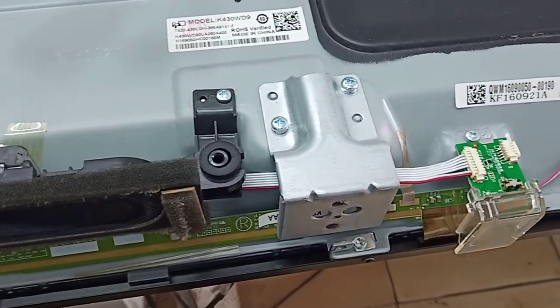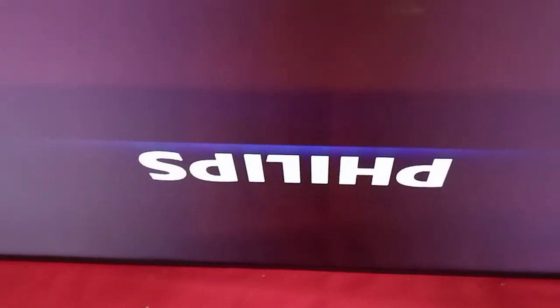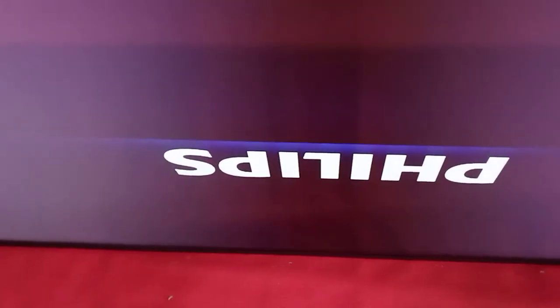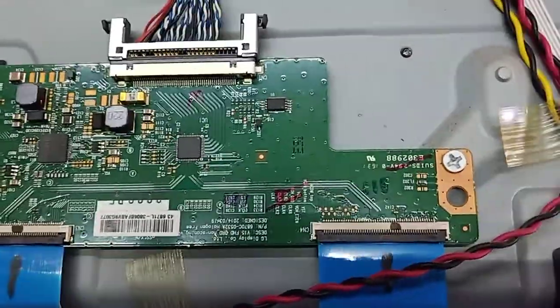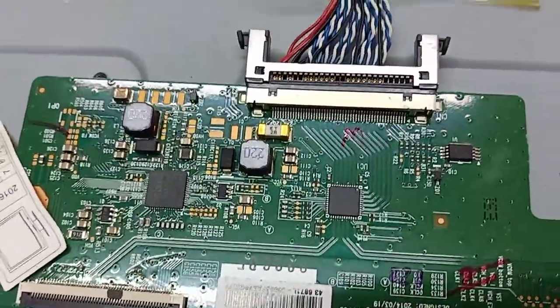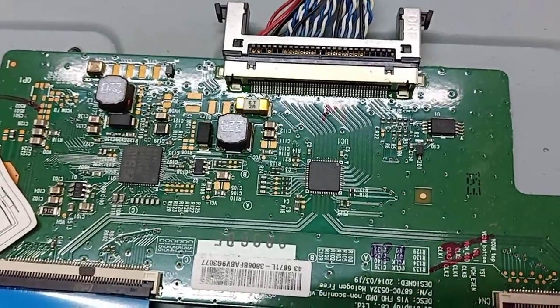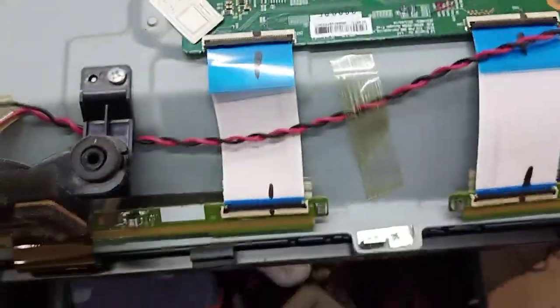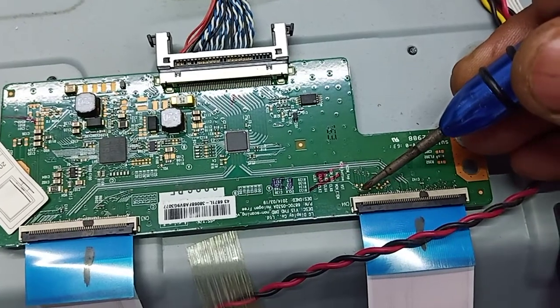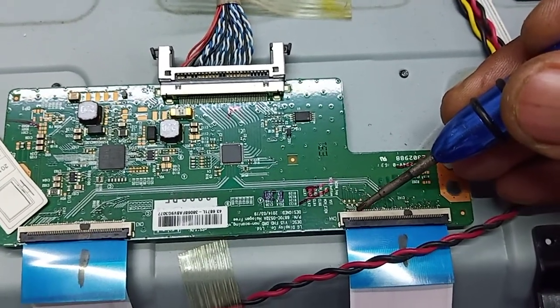I release from standby. This is a panel screen issue. We can cut the CKV lines — CKV1, CKV2, CKV3, CKV4. We have to block some CKV lines and gate lines. So CKV1, CKV2, CKV3, CKV4 — we need to block some of these CKV gate lines.